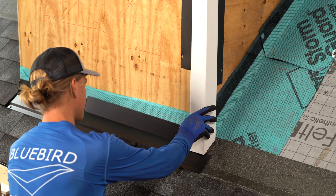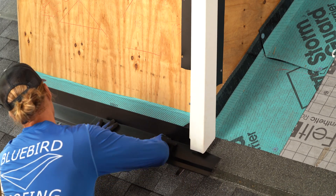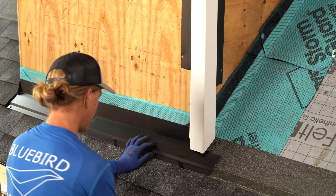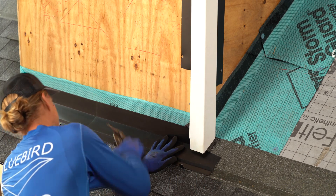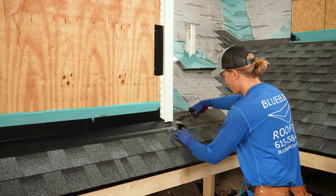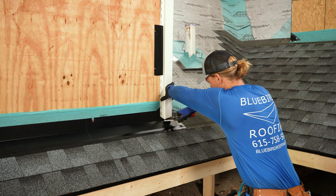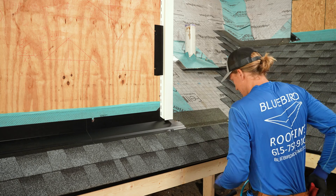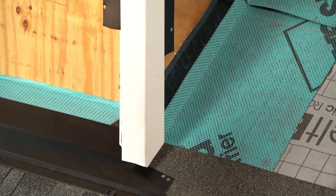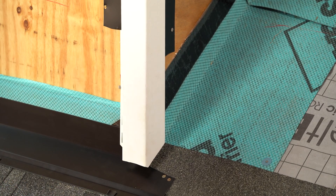Let's go ahead and stick this in, line it up at our corner, and then this piece hooks in just like that. Fold up our clips, trim off the excess. When you have a vinyl corner, there's often not a lot of space here to work. It is recommended and acceptable to go ahead and trim off a little bit of the bottom of the corner — about a half inch to three quarter off the deck — enough where you can see underneath it and get the tip of your caulk gun underneath to get the corner where the step flashing is going to connect with the apron flashing.